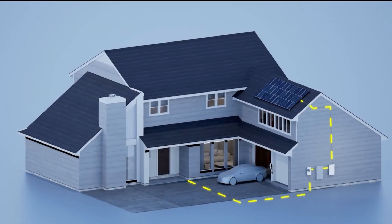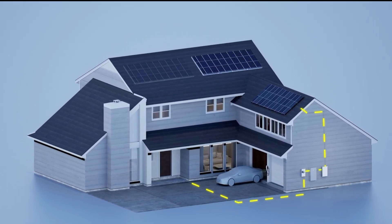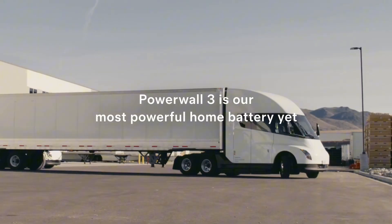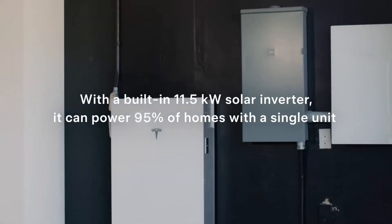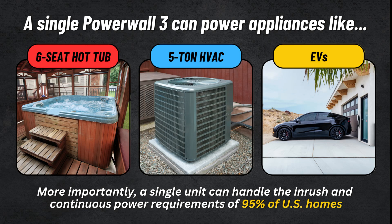The two key scenarios where you should consider a second Powerwall over an expansion pack is when you need that additional inverter power for either larger solar systems — typically between 16 and 20 kilowatts — or if you have larger electrical loads that need to be backed up in the home. Here's the reality: most homes only need the power output of one Powerwall 3. They don't need to drive faster; they just need to drive further. And that 11.5 kilowatts of continuous power is enough to probably back up 9 out of 10 single-family homes.